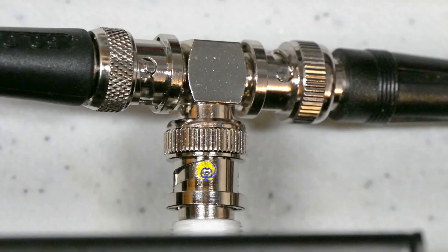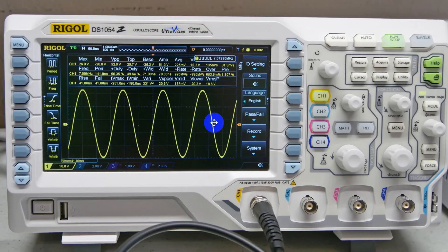This is the tap on the back of the micro BITX — it's a BNC connector. Power comes out of the micro BITX and goes off to the right to the dummy load; to the left it's seeing a very high impedance load at the scope. The piece of coax is so short relative to 40 meters that it does not introduce any weirdness. This is what we see on the scope — the sine wave. We can measure the frequency here; the actual carrier is at 7.0729, or about 7.073 MHz. And we've got our voltage peak-to-peak, with the voltage RMS just below it.